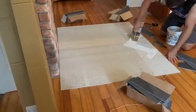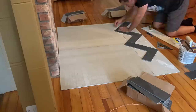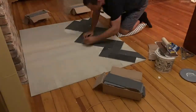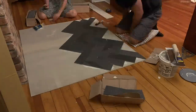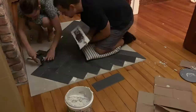I selected some slate tile I found at Home Depot — I'll leave a link in the description. It was the best option I could find, especially because we needed it quickly. I went with the 4-inch by 12-inch size and decided on the herringbone pattern. Our ember pad needed to be 54 by 48 inches, so we took a 3 by 5 piece of backer board, cut 6 inches off one side to make it 54 inches, and added a 1-foot piece from another backer board so it would be 48 inches coming away from the chimney.